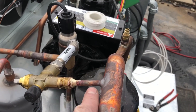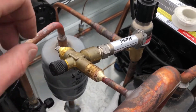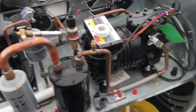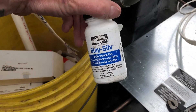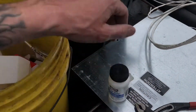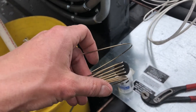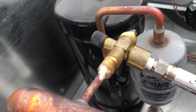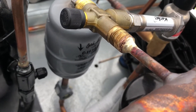I had to drill into the suction line here, put a piece of quarter-inch copper stub — you can see where that is brazed — but here I had to go copper to brass, so I used silver solder to do that. The brazing rod won't stick, so I usually use this flux here and just the silver solder that looks like a wire. That's what you got to do with brass to copper: use silver solder, clean it up real nice, put that paste on and she goes right around.